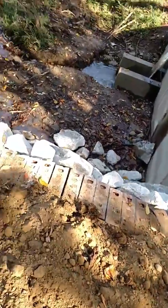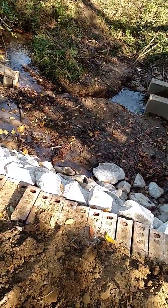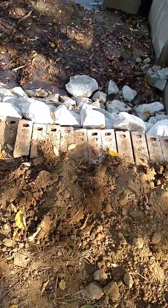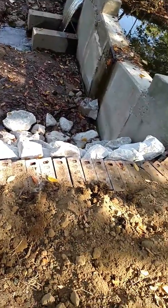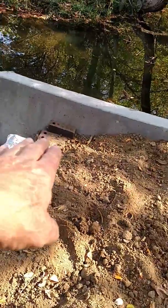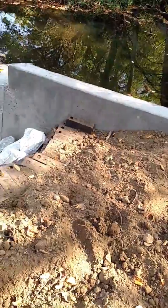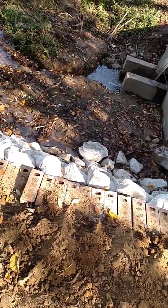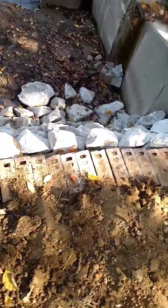I'm out of brick so I've got to count — about 25 brick per line. I need a dozen here; I'll get about 75 or 80 more brick and come up that level and one on top of that. Then I'll need a few back over here — I'll have to break it right in here where it drops down about four or five inches and then finish this out over here.